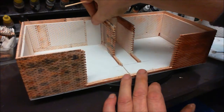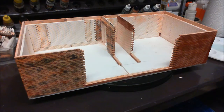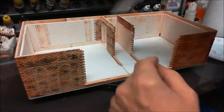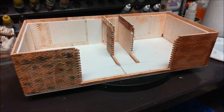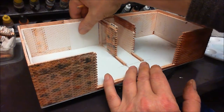All we're going to do is literally glue these to the wall with some PVA, and go all the way around and cover all the walls. This is going to give us a nice flat finish to either paint or put paper on. Now all I'm using is straightforward PVA, and they would call this dot and dabbing in the trade, but it's more like slathering. It's just a matter of going round, because if you kept your building nice and square, everything should go in nice and square. Me telling you to keep everything plumb and upright, there's a reason. It just makes your life a lot easier when you come to do the fancy work, like we're doing here. Right, it is as easy as that.